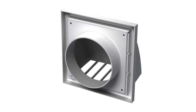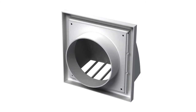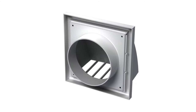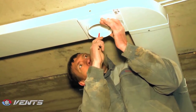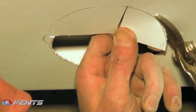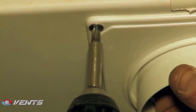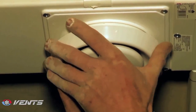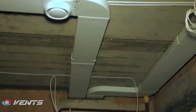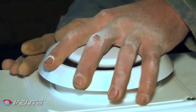The hoods of this type prevent vertical and slanting precipitation from entering the air ducts. The hood opening is meshed to keep falling leaves away. The supply air is distributed by 125 VR air disc valves, which have adjustable airflow rate so that the ventilation system can be balanced with a limited number of diffusers.